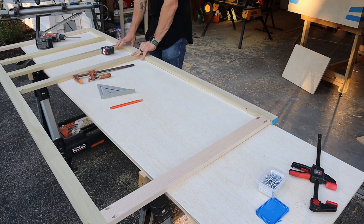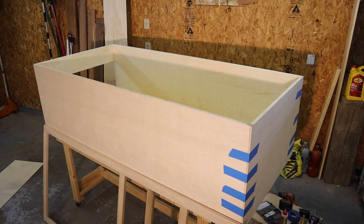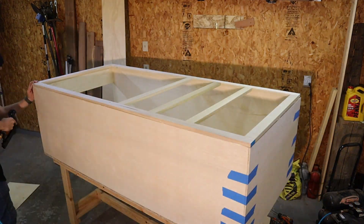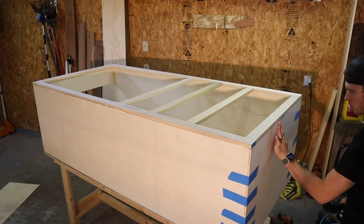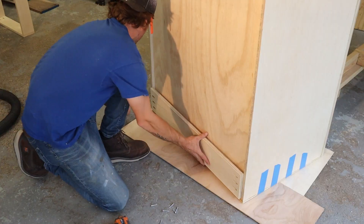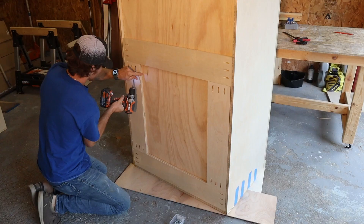Once it's screwed into one side, flip it around and secure it to the other long side piece. After creating your face frame you're probably going to need cabinet doors — I created a video on how to do that as well, I'll leave the link in the description. After checking the fit of the toe kick and the face frame, add a trail of glue all the way around the cabinet edge and carefully place the frame on top. After you're satisfied with the alignment, pin it down with just a couple of 18 gauge pin nails. Finally, the very last thing we need to do is to add the backing that we will be using to secure the cabinet to the wall as well as the drawer slides to the cabinet. This is the reason why we cut our groove three quarter inches in so that we could easily fit our backing wherever it is needed. Usually I just add backing to the top, middle, and bottom, but because I was adding drawers on the lower end I needed to put some on the bottom sides as well.